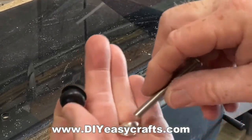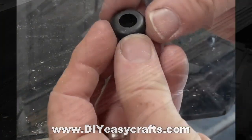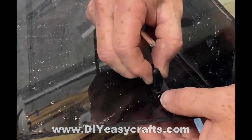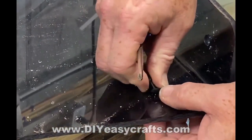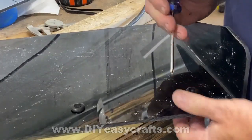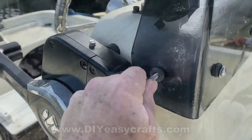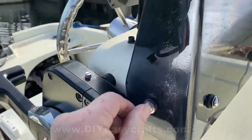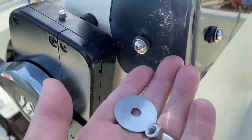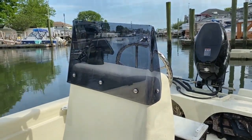These are the little rubber grommets — about a quarter-inch inside diameter, requiring a three-eighths hole through the Lexan. I squeezed one and tried to force one end through the hole — easier than it sounds, though it took a few minutes. You do have to force that one side through. I just used a small-diameter Phillips screwdriver. Once you get one going and figure out where to press and push, it goes pretty easily. Mounting it to the boat was simple — I marked and drilled holes, then inserted stainless steel hardware: a washer on one side and a fender washer with a stainless steel nut on the back. I didn't use lock nuts, but I did apply silicone to the threads so vibrations won't cause the nut to get loose.